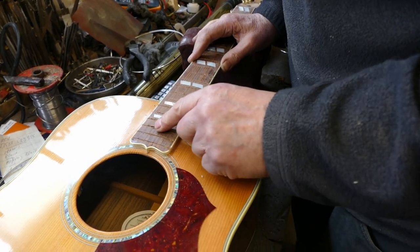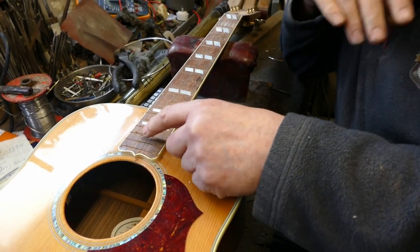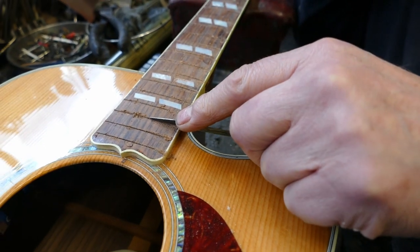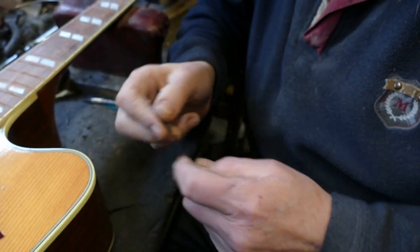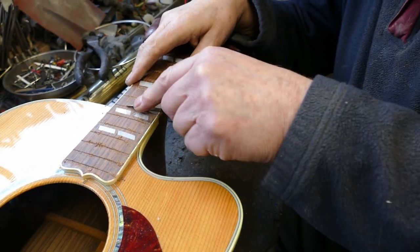How can you gauge the 1.3mm tang depth that you're cutting there? I just look. You use a human eye? Yeah, because I'm used to it. That's deep enough. That thing's probably about 2.5mm, 3mm. Yeah, that's plenty deep enough, so that means they're all plenty deep enough.